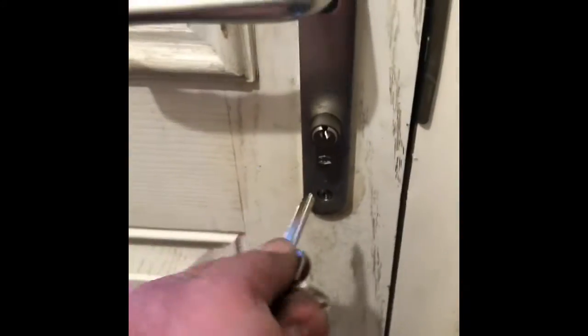Okay, last screw. You need to line them up — they pop out — so make sure you do it right. This is the minute of truth. Bingo! As you can see, now I can take the key out — I could not before. I hope this gives you an idea. Do not forget there's a screw in there that holds the cylinder — if you forget that, you're not going to get it out.